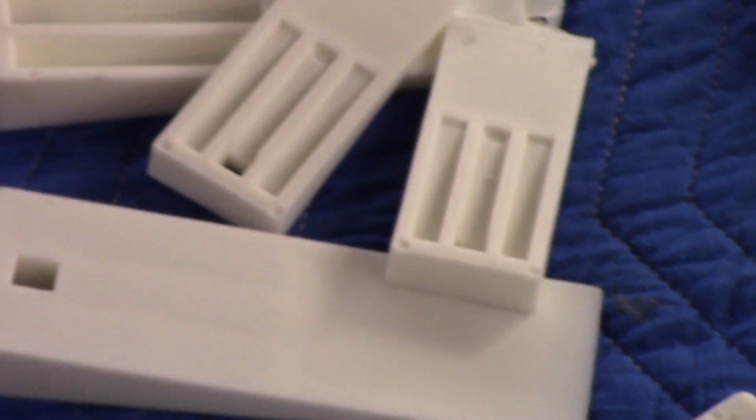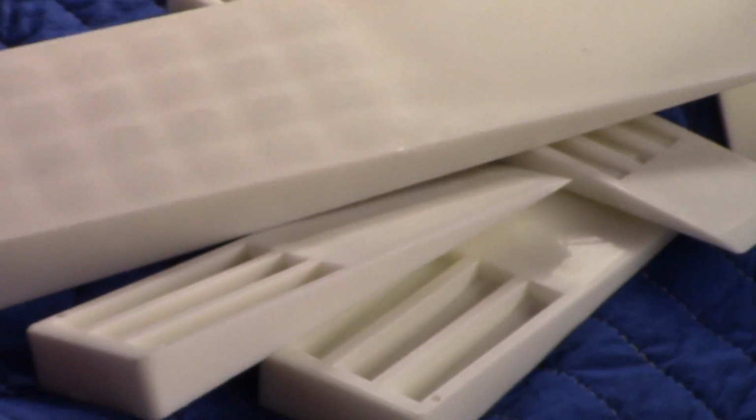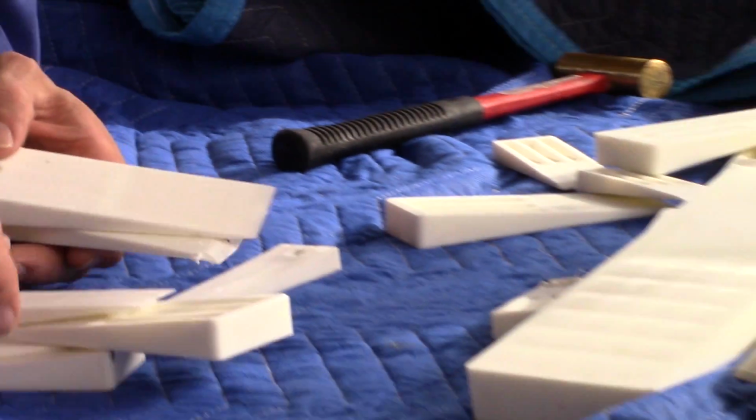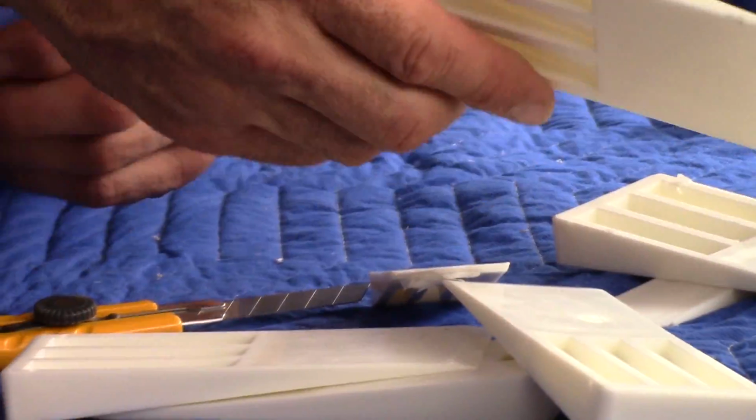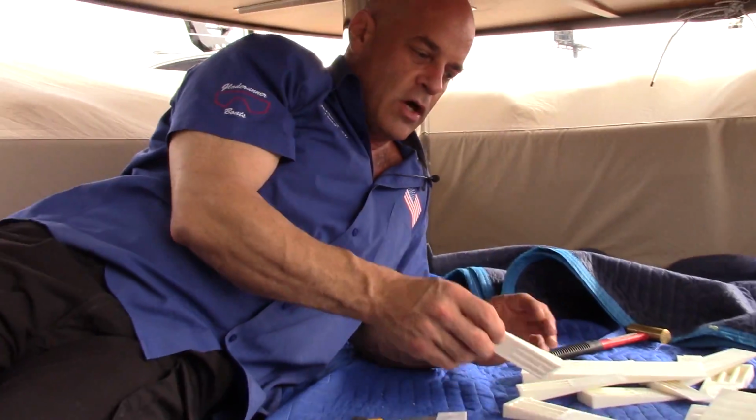See some white caulking around the stainless. We're trying to lift on the table. You can actually hear the veneer pulling. No, it's some strong glue holding it down. Return to the shop and get a bunch of wedges. I don't always carry this many wedges with me, but I needed a lot to break this free without tearing up the veneer. So these are just nominal plastic wedges, and you can use them to get this off with.